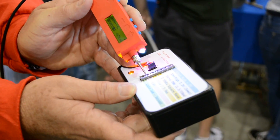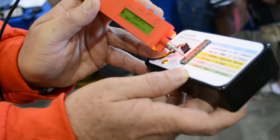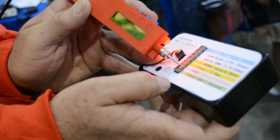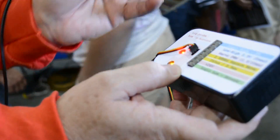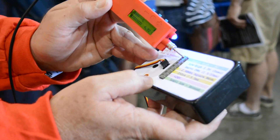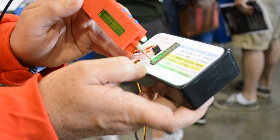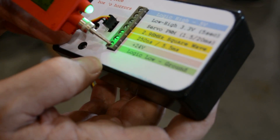But if you also hit a 24-volt line connected to your motor drive, it just measures the voltage for you. It gives you a red light to warn you that that's not a logic voltage, but no harm done — no buttons to switch. You've got basic logic probe functionality with the LED also indicating the logic level, so you don't have to look away from the probe itself.